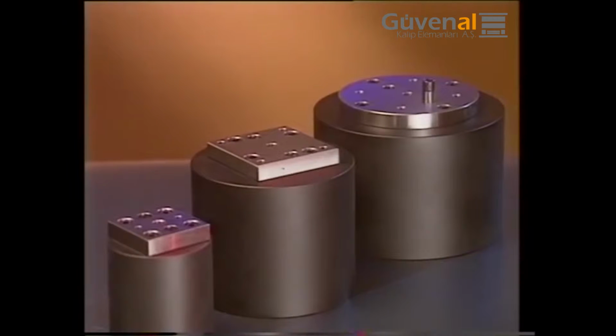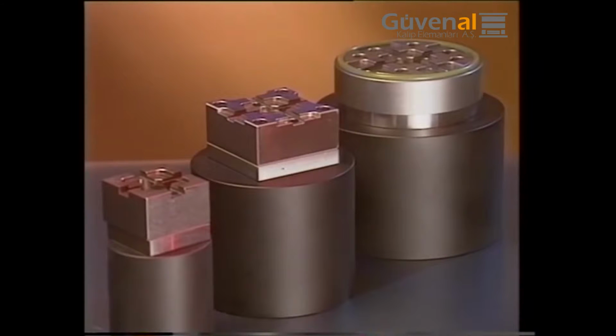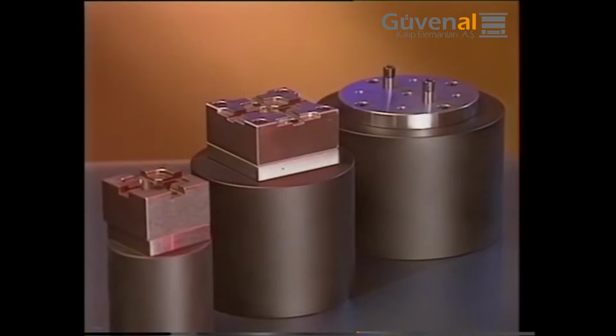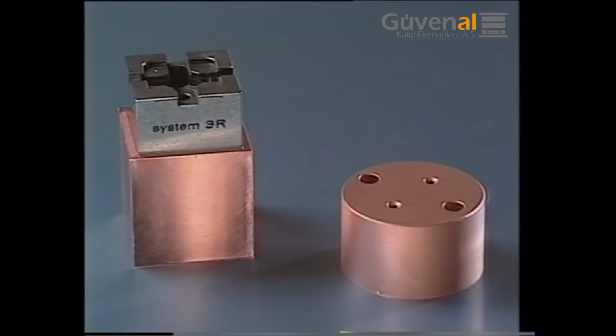With a combination of macro holders and 10mm refix, System3R offer without comparison the most ingenious electrode management system on the market. The refix holes permit the macro holder to be removed and refitted without any later need of adjustment. Refix holes can be made directly in the electrode blank or in simple adapters that could also be made by the customer through conventional machining methods.